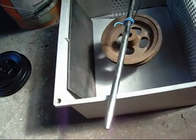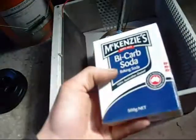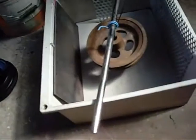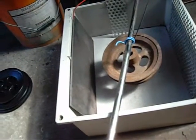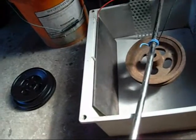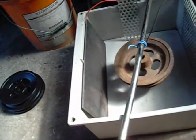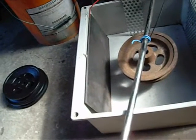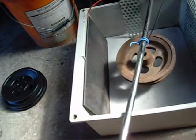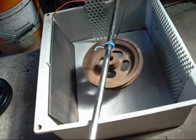It all depends on how much current you are transferring through it. If you put half a pound in a small tank it would create a very strong solution — running 50 amps through it would really work well but it might overload the power supply. The stronger the electrolyte is, the more load it puts on the power supply, so you can afford to go a little bit weak; it will just take a lot longer.